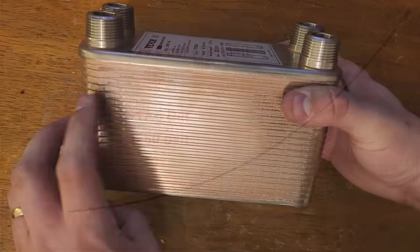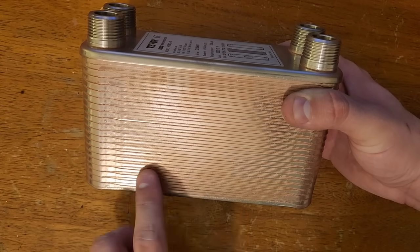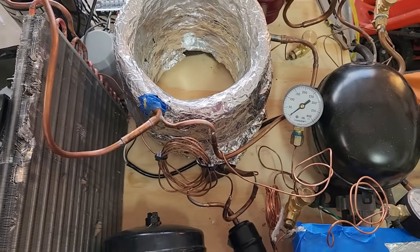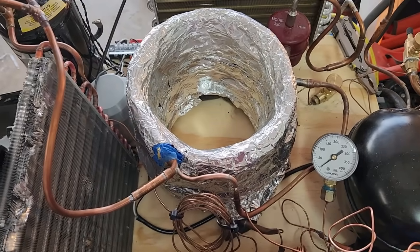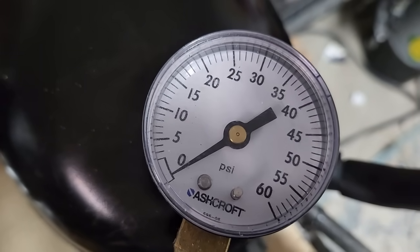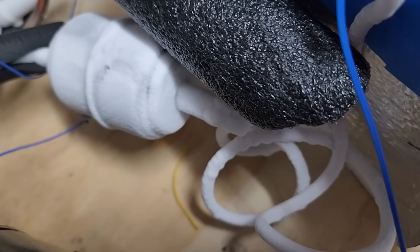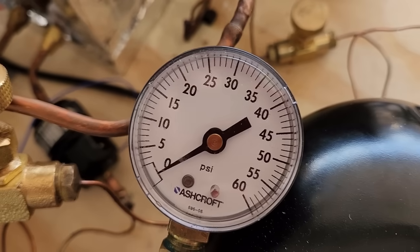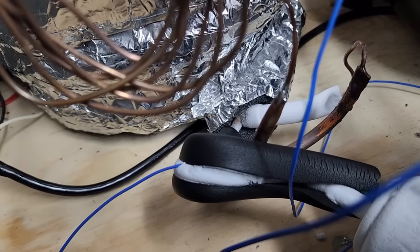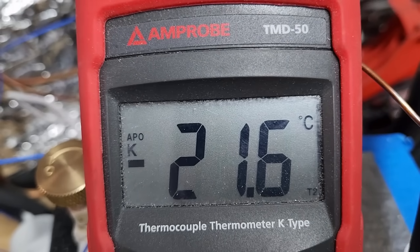Maybe the problem was that I wasn't getting good heat transfer. That seemed unlikely, since these plate heat exchangers are supposedly extremely efficient, but I needed to get to the bottom of this, so I replaced the plate heat exchanger with my original coaxial coil that I built in the first vapor compression video. I ran the same test with propane in the second stage, this time reaching as low as 75 psi in the condenser instead of the earlier 90, which suggested my coaxial coil was getting the second stage refrigerant colder than the plate stack was. It seemed to be working, so I loaded my ethylene back in and tried again. Once again, I went well over 400 psi on the high side and things were definitely getting cold, but not any colder than the first stage evaporator, which again implied that all I was doing was cycling cold gas without any phase change.